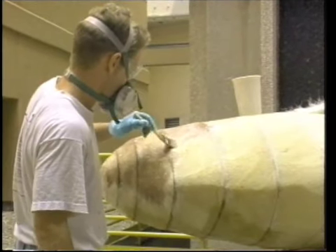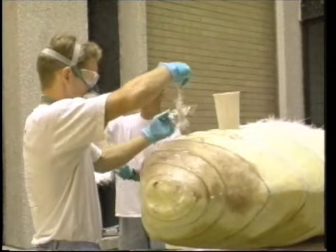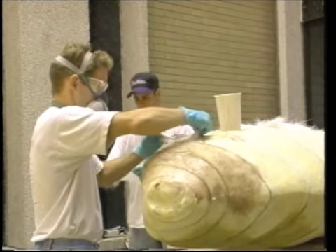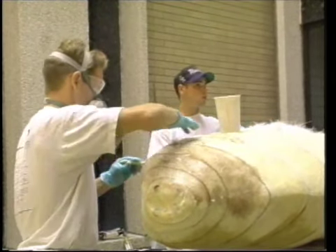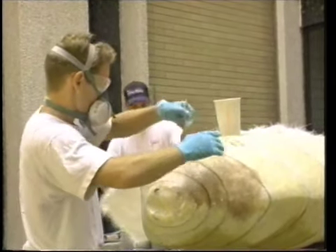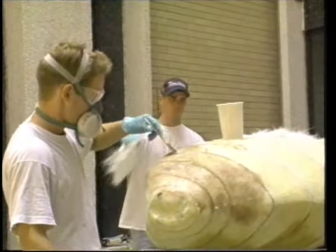Try to work out the larger air pockets by stippling with a brush or wiping with your gloved fingers. A groove saturation roller also helps to remove the air. Mix batches of resin in quantities which can be applied before the cure sets in; begin with small pots until you become familiar with the cure cycle. As you go along, make sure that each piece is laid properly without trapping air, so that if the resin does set up, you don't have poor adhesion problems.